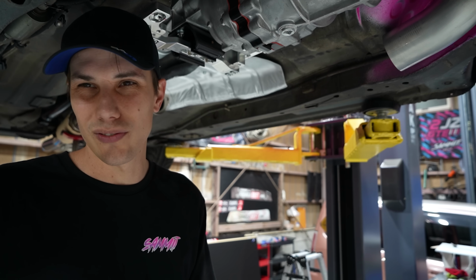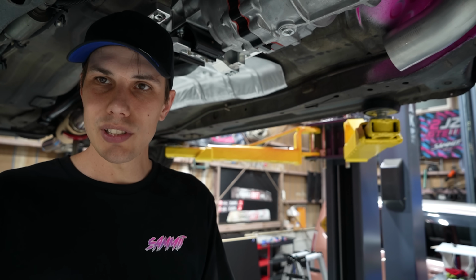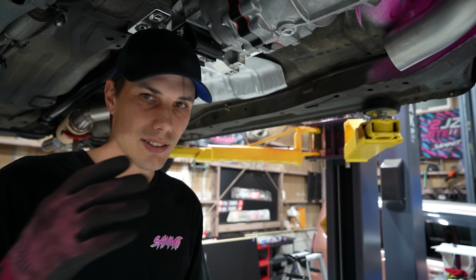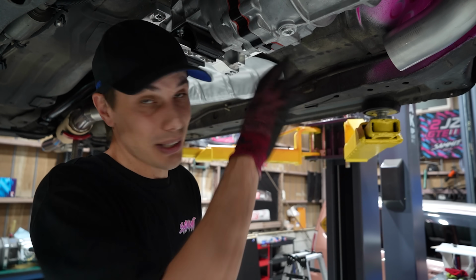100 mil is closest to 4 inch, but that's technically 102 mil, so it's like 2 mil off. If you go to order, I think it's like 77 mil or something, they sell that, but I think 3 inch is 76 mil. So it's always a little bit different. If you're trying to make 3 inch stuff with metric stuff, it's a nightmare actually. But thank God Vibrant looks after us because we can make all this work.